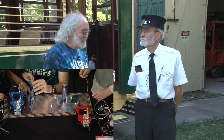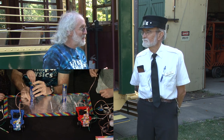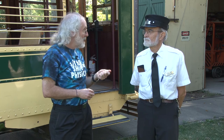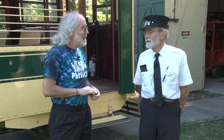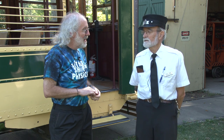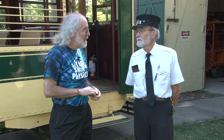Just like in your house, you don't have any exposure to the current through the plugs in the wall. And since this is a voltage of about 630 volts, you don't want to be touching that — it's very carefully insulated. We looked at batteries in the studio that have a voltage of about one and a half volts, so this would be about 420 batteries all stacked up. Running this with a battery pack would be a lot of batteries. It's an almost 100-year-old piece of rolling history that works the same way as when it was first installed — we've known about electricity for quite a while, but they were very clever in using it for streetcars. The basic idea is the same in principle as the light rail in Denver.